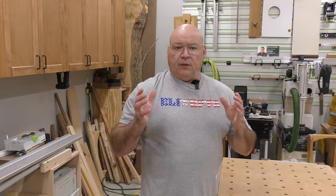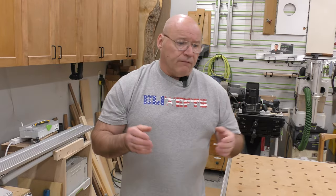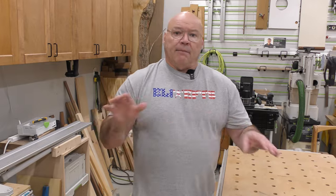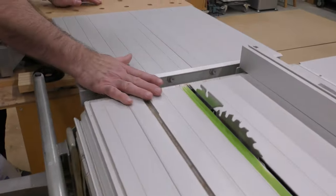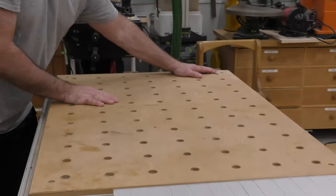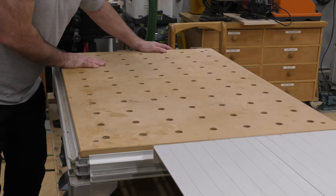Being organized is also about being very efficient — I don't like to move things around too much, I like to save time. One of the first things I always do when I move into a shop is level all my benches, and I try to make my supporting tables all the same height as my benches or close to it. Right now my assembly table is near the height of my table saw, and I have this slight drop here which is my outfeed table.